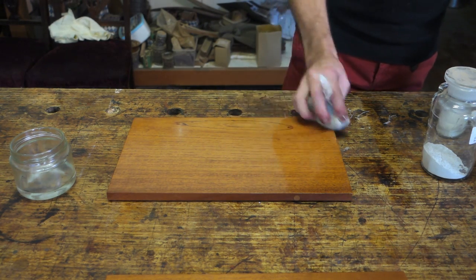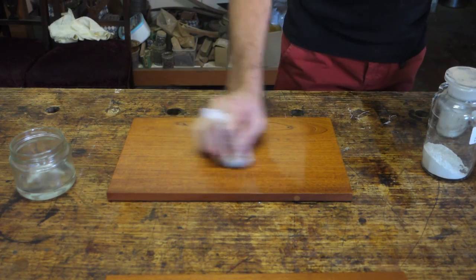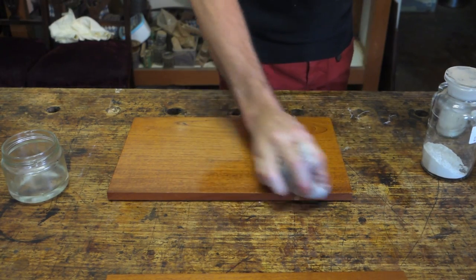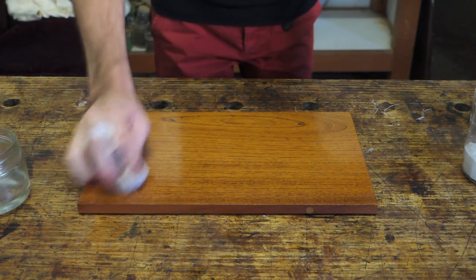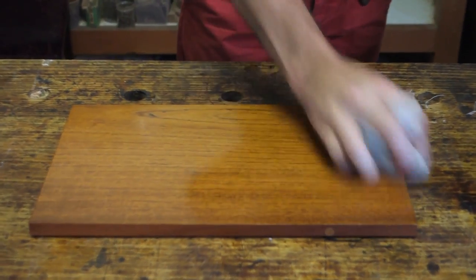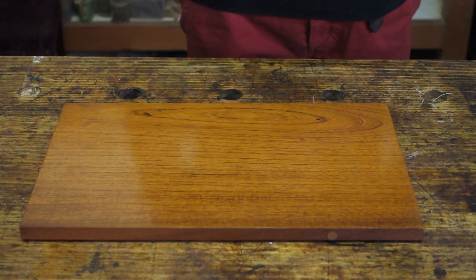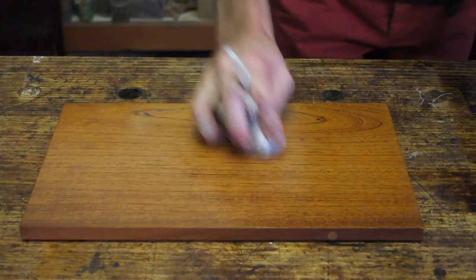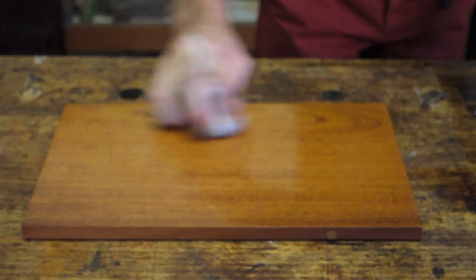This is the bodying stage. I start in a similar way to the grinding stage, which is basically circles, and I'll keep doing circles for quite a while. What I'm looking at doing is not so much one coat, two coats, three coats, but I'm looking for a build — basically a film of polish building up on top of the surface, which has already been filled with the pumice and the shellac. It's always a good idea when you're using your circles to change directions. If you keep mixing them up, you're less likely to get a defined pattern of circles throughout the whole surface.